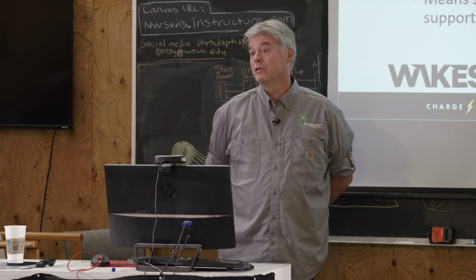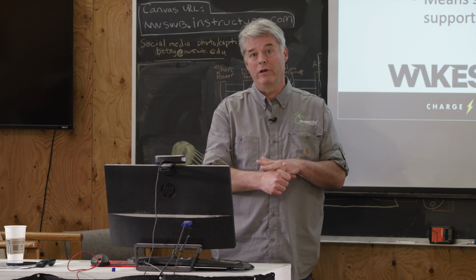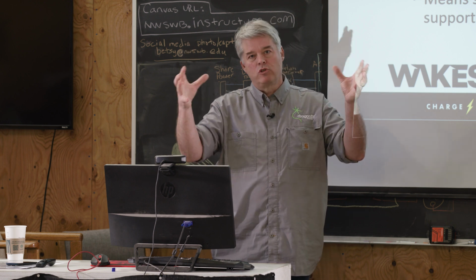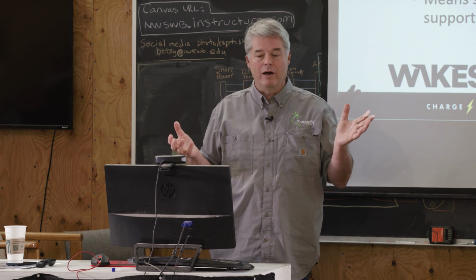There are requirements around grounding of the solar panels, and they're different in the marine world. Just like an inverter, you have to run a safety ground wire. Same with solar panels, you have to take that into consideration. So make sure you research and understand what that requirement is.